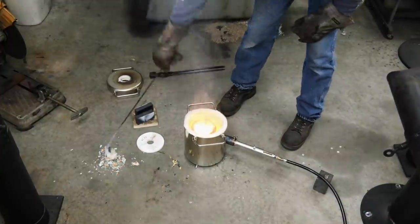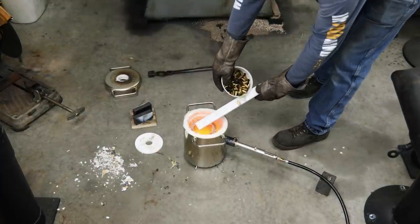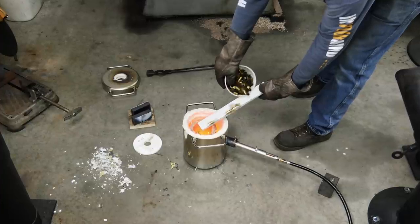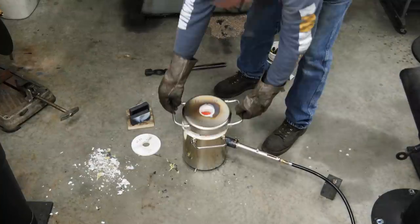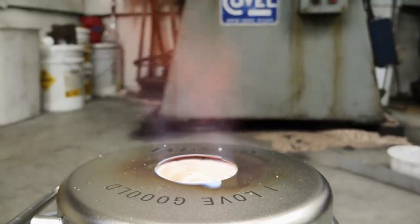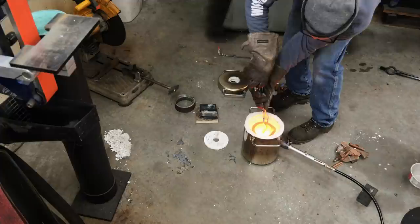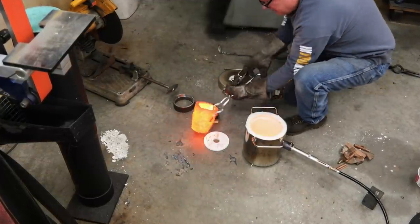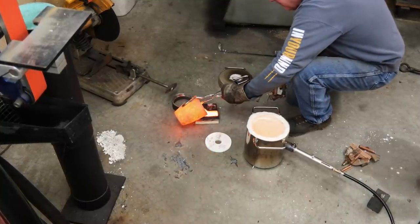You want to make sure that your brass is dry. If you pour anything with any moisture into your crucible when it's hot like this, it will explode. I've done this before and it gets very volatile when you introduce water. Kind of a funny story — when I was sorting this brass out, there were 30, maybe 40 live rounds in the brass. I actually found a .22 live round in with it. I had to make sure I took that out before putting it in the crucible because it will ignite. This is hot enough to ignite that unspent cartridge, and that's bad.